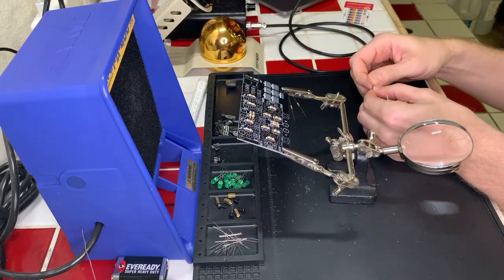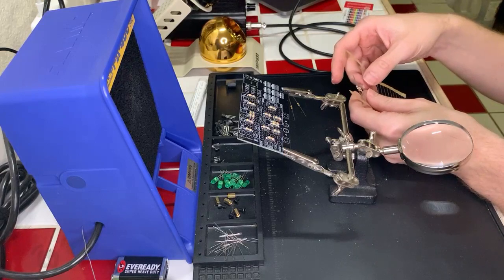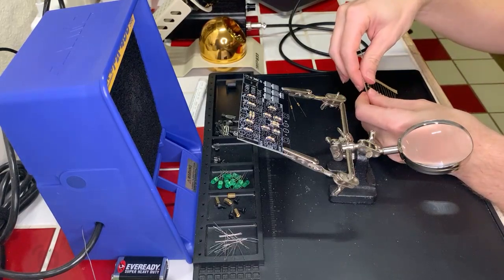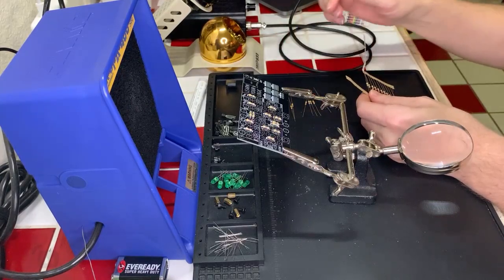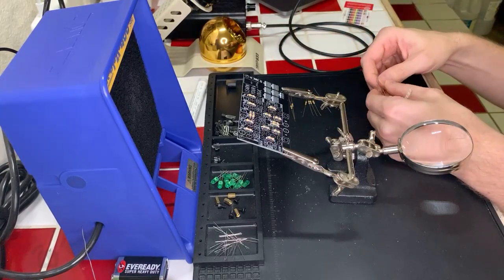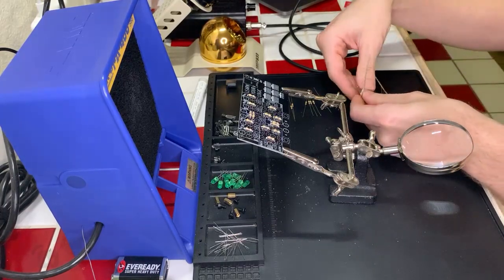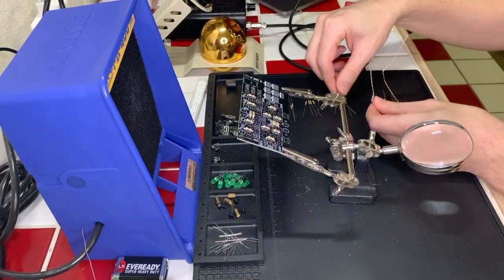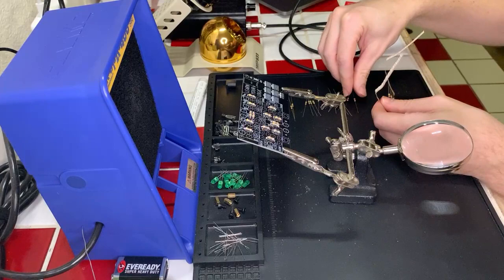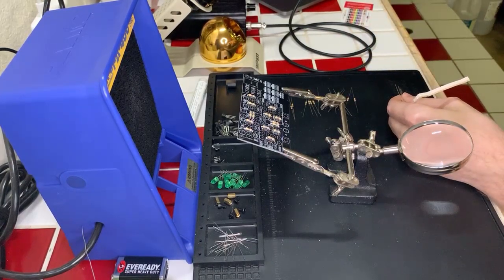I've also done just a more basic little LED light board, and then one that has some potentiometers connected to a multicolor LED, and so you can change the color on the LED by turning the pots higher or lower and increasing the amount of electricity going to that particular LED inside the multicolor LED. So you can do multiple colors. It's kind of fun. And this is all, like I said, to build myself up to the big project, which is the Bluetooth speaker kit.